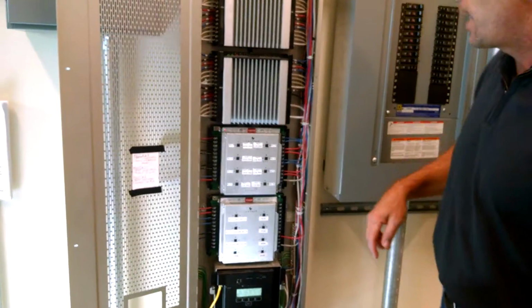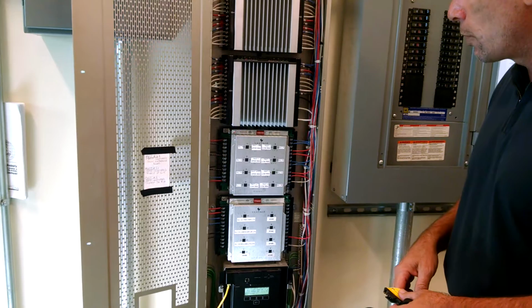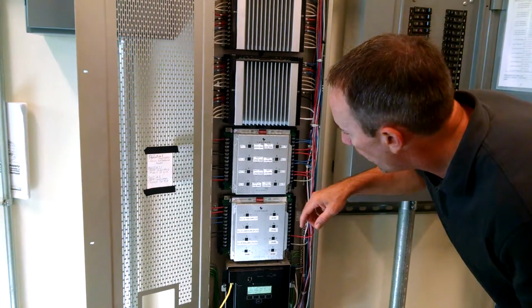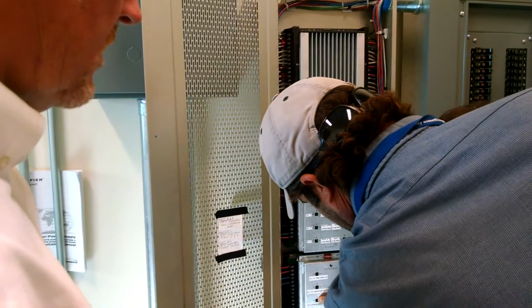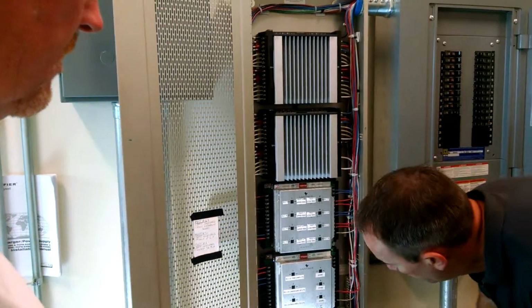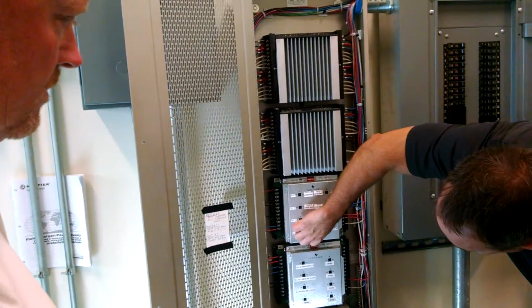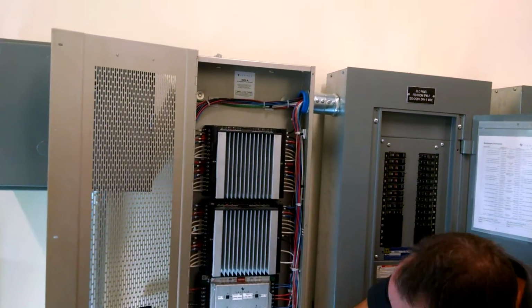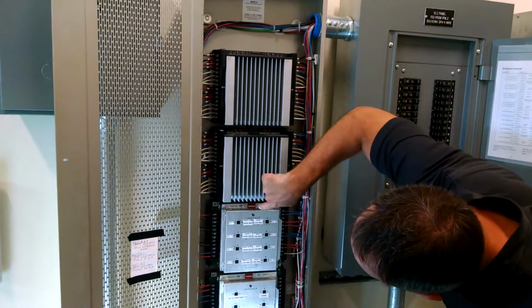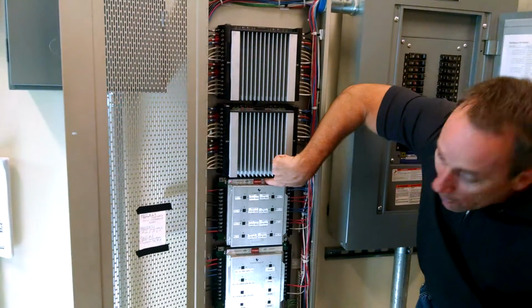These, if you took a screwdriver, you can actually physically turn them on or off, force them on or off right here. And earlier when you were talking about the manual override, they're off right now. Well, these three dip switches that control these circuits will come on with the manual override. You see these three dip switches are 1, 2, 3. The rest of them are in the off-down position, for your spare. Over here, none of them are on for whatever reason. They don't have them on.